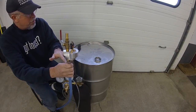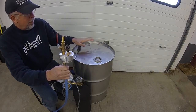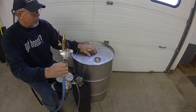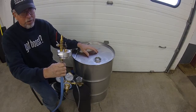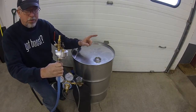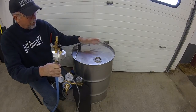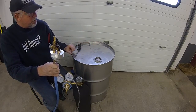We put enough nitrogen pressure in to preserve the front ends of the fuel. This fuel's got a Reid vapor pressure rating of say 5 psi, which would be equivalent to the true vapor pressure of the fuel — what you might get at 70 degrees, a typical storage temperature. As you may have seen in the earlier YouTube video of the Reid vapor pressure test, that test is done at 100 degrees Fahrenheit, but typical storage temperature is more like 70, and at 70 degrees the vapor pressure is lower.